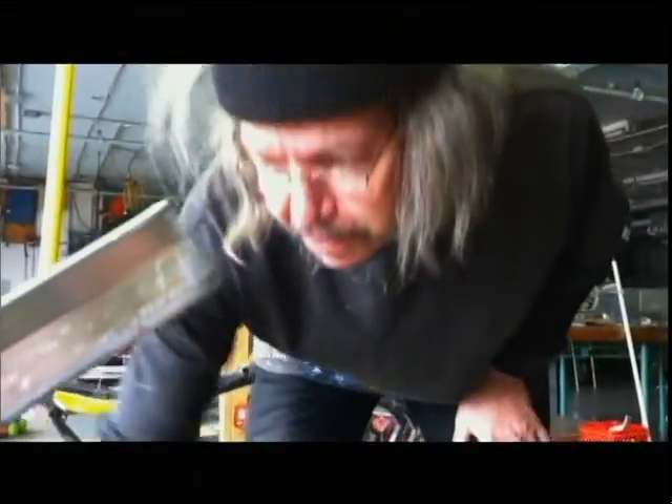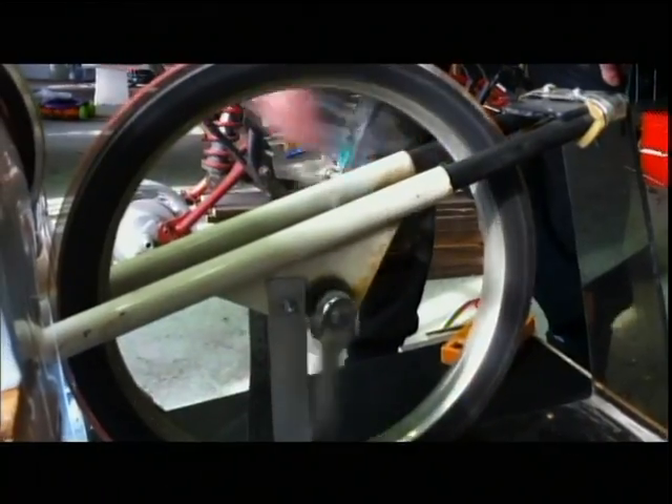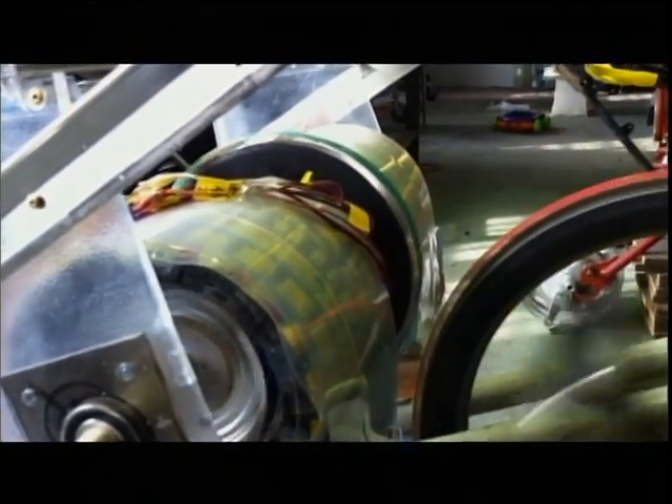The pedaling to generate your energy until the air turbines in front can kick in at 20 or 30 miles per hour — it works. And it can be increased by better magnets, lower tolerance between the magnets and coils, and adding more coils.